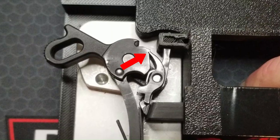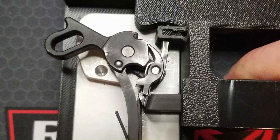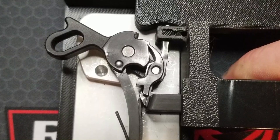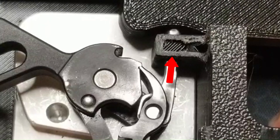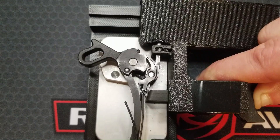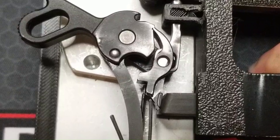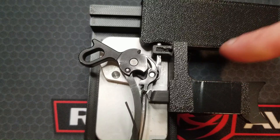Now the sear is engaged with the hammer hooks. The hammer is cocked again and the slide has gone back forward into battery. The pocket in the slide is once again over the disconnector. As I let my finger off the trigger, the middle tang of the sear spring pushes the disconnector and trigger bar forward. As soon as the disconnector clears the front edge of the sear legs, the middle spring tang forces it back up into the pocket in the slide and the base into position in front of the sear legs. Letting my finger all the way off the trigger, a gap once again opens up between the disconnector and sear legs and the whole cycle can restart with the next shot.